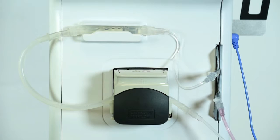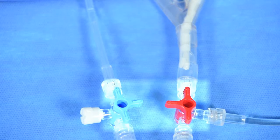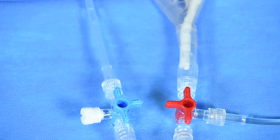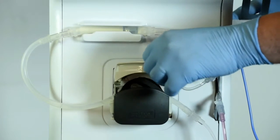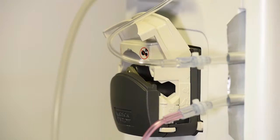To take corrective action, switch off the pump by touching the on-off button on the touch screen. Check that both the blue and red stopcocks are in the recirculation position, which is closed to the installation and drainage ports. Open the pump head to check the integrity of the long, thin silicon tubing. The tubing may have been perforated by the pump head teeth.